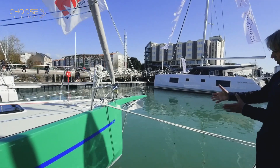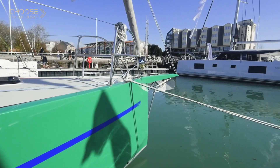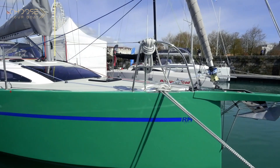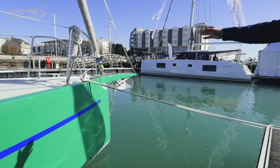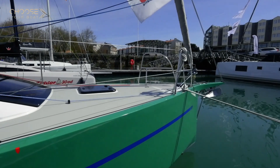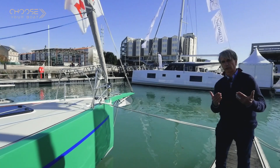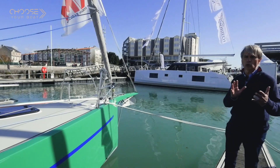The first thing you see with an RM, whether at anchor or here in a marina, is how it is built to plane. This is visible right away due to the large volume at the bow and in the first quarter of the boat. This volume pushes the entire hull upwards. The forefoot is not submerged and there is a slightly inverted bow to improve the waterline length and give the hull a dynamic look. The boat is rather light, with a fairly light displacement. The design wasn't intended to optimize the waterline length but rather to optimize planing, just like today's racing boats or fast blue water cruisers.